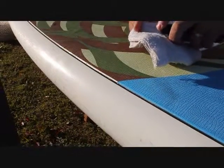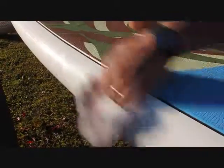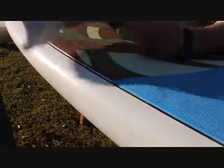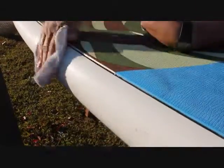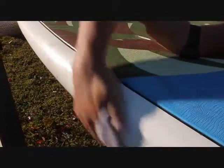You can do one or two applications of the product, and a warm sunny day is the optimal day to do it. If it's cool or you're doing it inside, it's just a little extra work, but it certainly can be applied there. The purpose of the warm day is to get the paint pores open and let this product really deep clean down to the original coating, whatever it may be, and then apply and seal it with an acrylic seal.